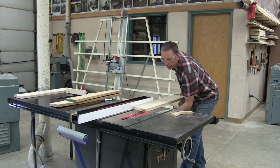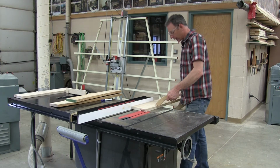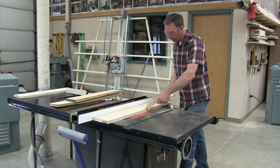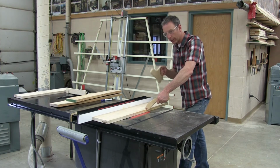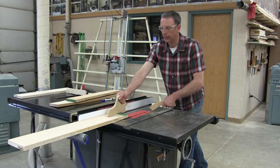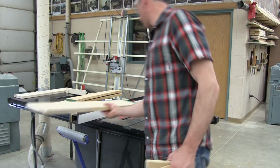I'll lower this first of all to show you. It's going to look like this. So this same position, push through, slides at the blue. Once you get to the table, you hold tight with your left hand, your right one comes up, and then you continue pushing through, right to that blue line, up and over. Okay? So let's see what that looked like with the blade running.